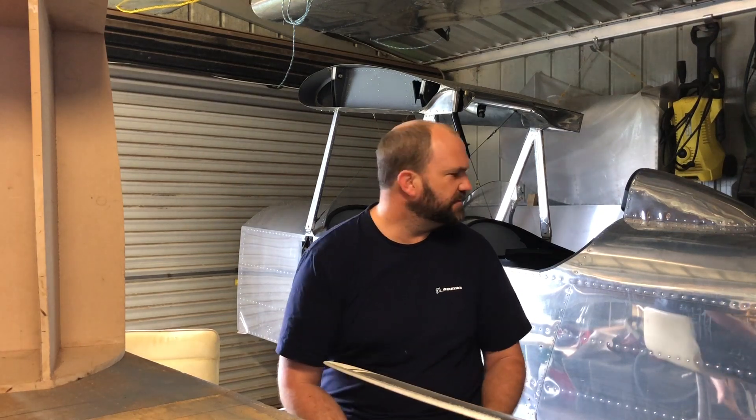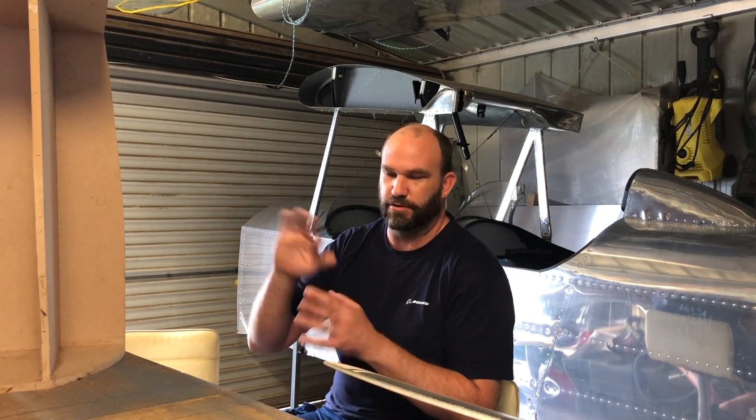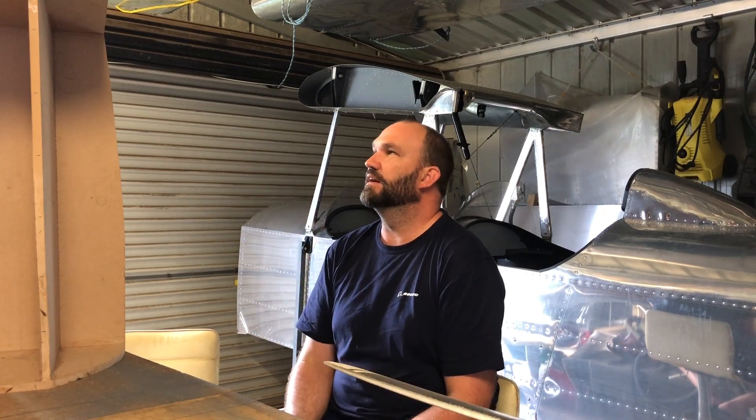I think I've got some plastic — the joystick's plastic, the grip — that's it. Everything else is aluminium, so we're sticking with that. 5005 is the material spec I'll be using; the aluminium is about 25 to 30 thou. It's easy to work with for the compound curves and stuff like that.